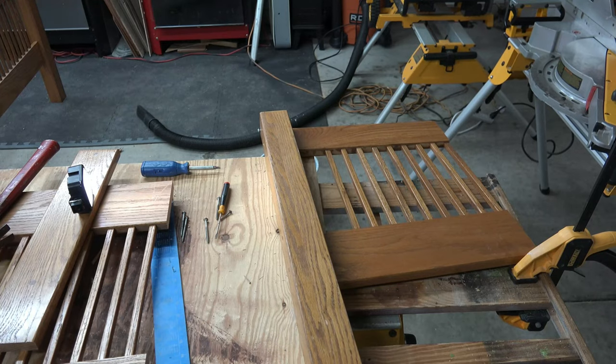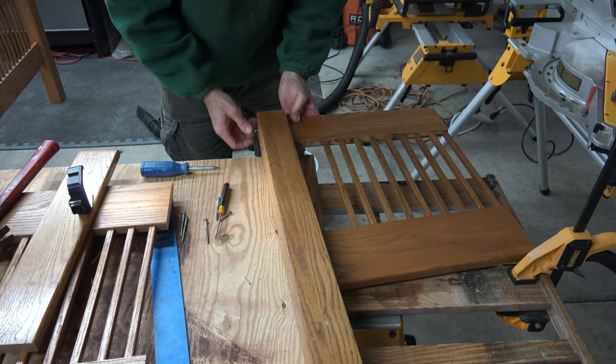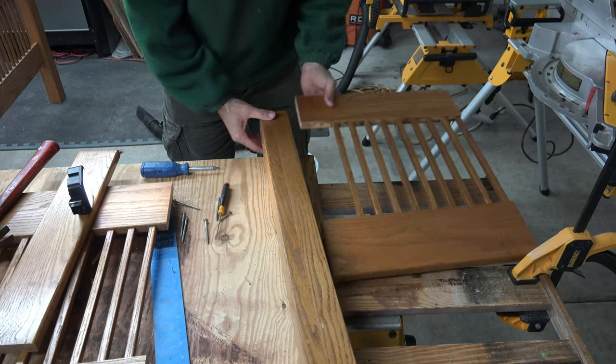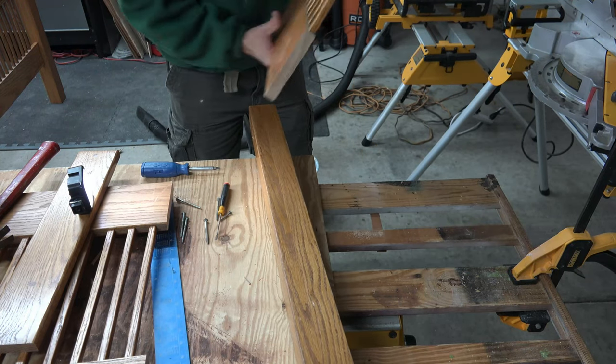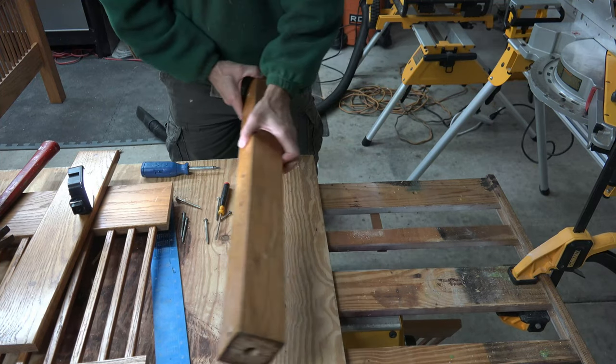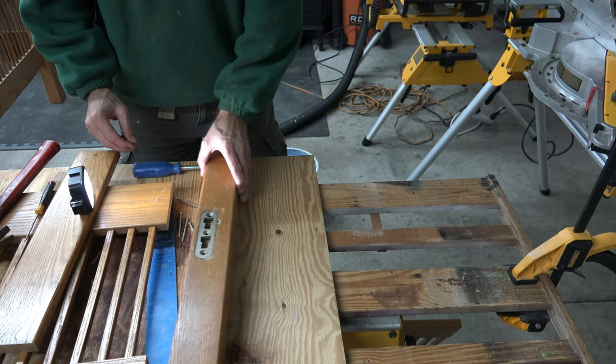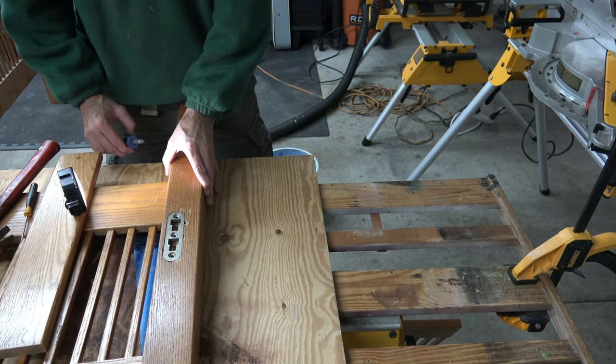You will be limited by the number of pieces you have to work with, so don't just start cutting the wood apart. Besides, hitting screws with your saw blade dulls the blades quickly. So in this next step, let me show you the best way to remove plugs so you can access the screws below and save a lot more wood in the process.